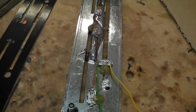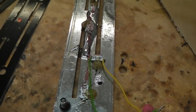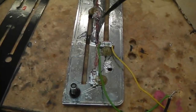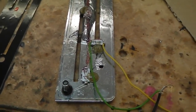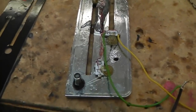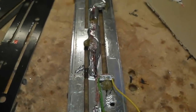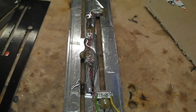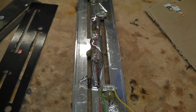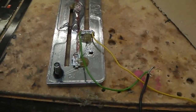We did that, and then the cables can handle the current. I've doubled up there, and it's daisy chained across, and well, I hope it can handle the current. It certainly hasn't shown any signs of any problems. That cable is very fine, but I'm sure it'll be okay. We're limiting the whole lot through a 100 ohm resistor as well, so I could calculate the current out. I'm not going to, I'm just going to see if it works. We'll leave it on for a couple of days. If it lasts that time, it's going to last. I'd imagine we're going to be okay.